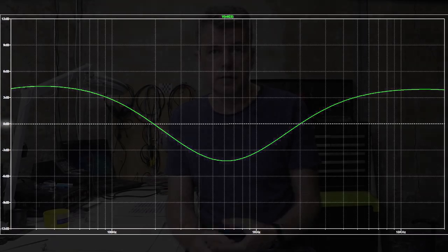And that's really why I'm building this into a stomp box, so I can use it as a slap contour and kick it in and out whenever I want to, even in the middle of a song. I thought I might also use it when I practice bass with headphones, because the bass boost and mid cut that you can get with a Fender tone stack sort of counteracts the really mid-rangey tone you get when you plug a bass directly into a sound card.